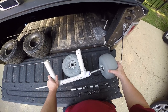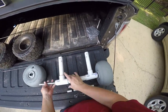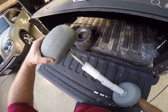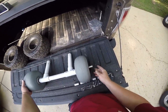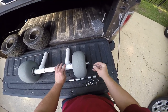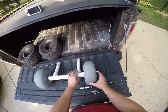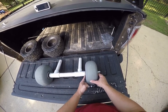Put the wheels on the shaft. Now you'll see that I've evened it up — you've got some extra space, so the question is where do you want to put the space? You can see the pin is going to go right there in that hole. I can either put the spacer on this side or over here. I've decided it's best to put the wheel as close to where the load is going to be as possible, so there's minimal chance for deflection of the shaft.